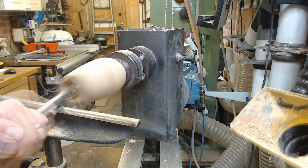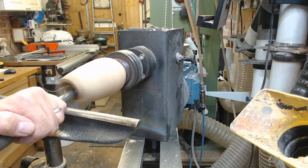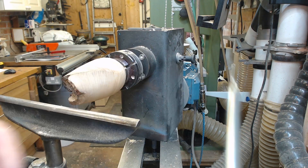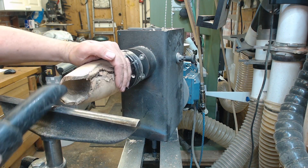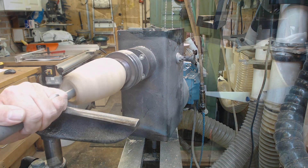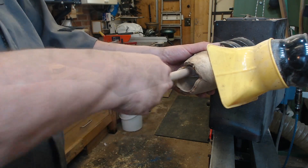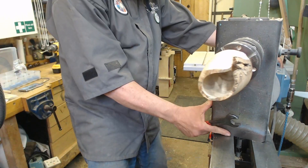I won't show you all of the hollowing — you'll be pleased to hear. There was a little bit of an issue near the bottom because of the bark crack that runs through the very centre of the vase — I had to leave it a little thicker than I would have liked. But that actually gives a nice weight to the bottom and helps it stand, because it ends up with a very simple foot — I wouldn't even call it a foot, just a sanded flat on the bottom. I wanted to keep the curve going as much as possible, so you'll see that being done when the sanding is completed. It's quite difficult to sand something with such a jagged opening, so I resorted to my sanding stick. The scraper had done a good job of smoothing out the ridges.